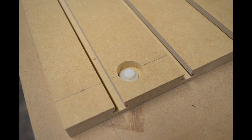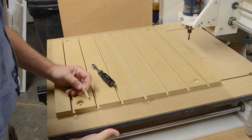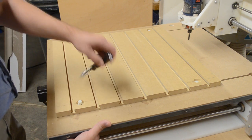The next step is to mount your spoil board to your particular CNC bed. I use nylon bolts for this — that way if I happen to hit one with the router bit, no problem, I don't damage the bit. The actual location of these mounting bolts will depend on your machine's table.